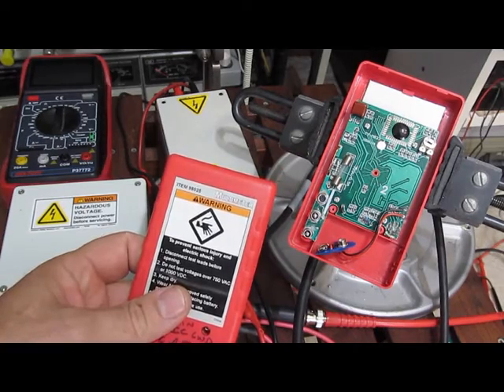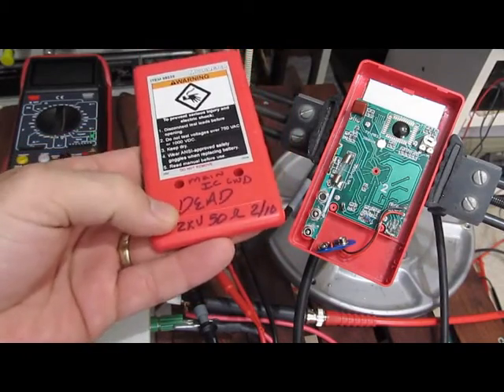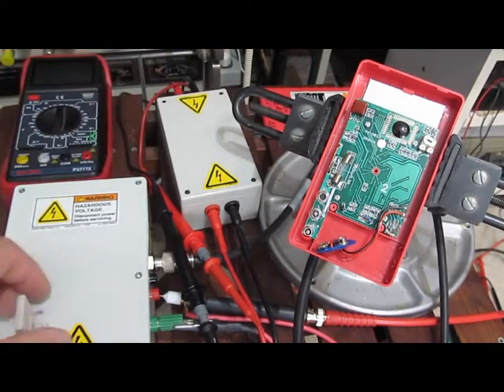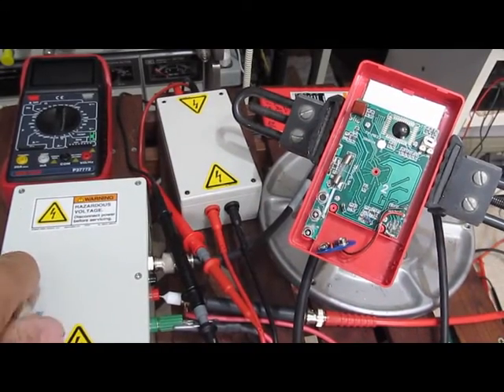These are pretty good — the 98025 Syntec. This is one that a friend of mine, Brian, gave me. It died at 2 kilovolts with 50 ohm source impedance. I'm going to apply the big transient to this now and just see if it'll take the back off of this IC — this is what I'm pretty sure is damaged here. Let's go.